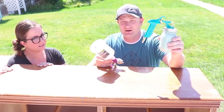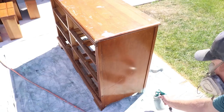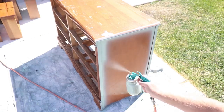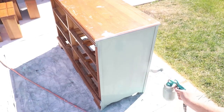Let's take a pause for a minute. The purple gun in my right hand on your left side is an HVLP sprayer. We don't like to use milk paint with that because it can gum up — it's got a lot of metal moving parts and brass inside and the milk paint sticks to that really well. This critter sprayer is really easy to clean, and that's the number one reason why we use it with milk paint.